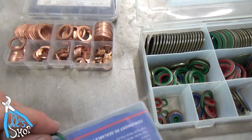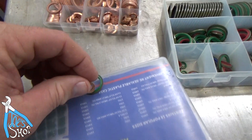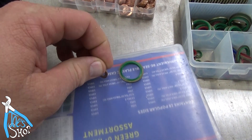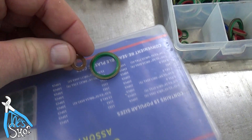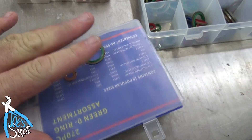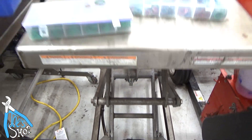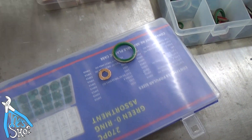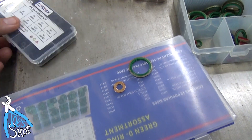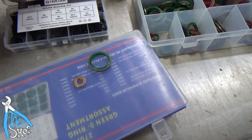I also think that a crush washer would have worked in the application of this cart. However, you can see there's that added benefit of the O-ring in there. This cart has some non-standard sizes that aren't quite metric and aren't quite standard. The annealing thing — if you haven't seen Scott Crafter's crush washer video, go watch that — I thought it was quite interesting that you could anneal the copper.